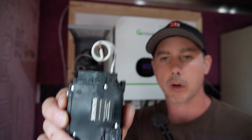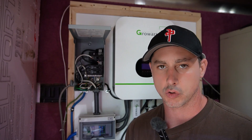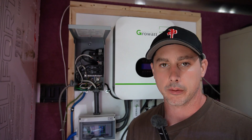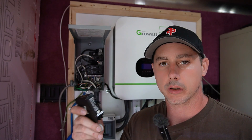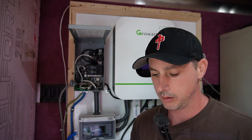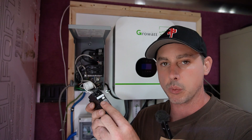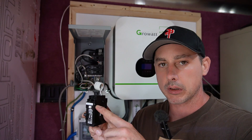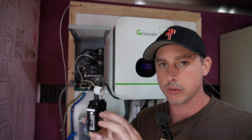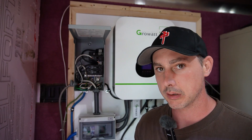You never want to back-feed your GFCI breaker — in case of a storm or anything, you never want to back-feed your house at all. If you have one of these hooked up to your sauna or anything, these are not meant to be back-fed. That's why it says load side. There is a little electronic device in here that if this were to trip, that electronic device needs to deactivate, and if you're back-feeding it's not going to deactivate, so you're going to pop your expensive breaker. Do not back-feed a GFCI.